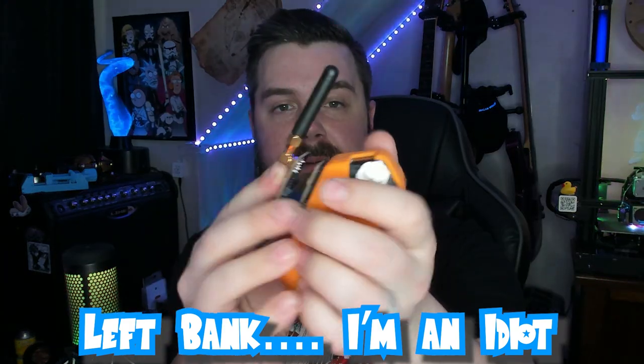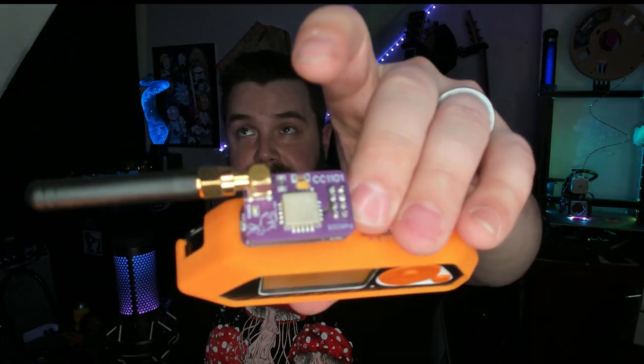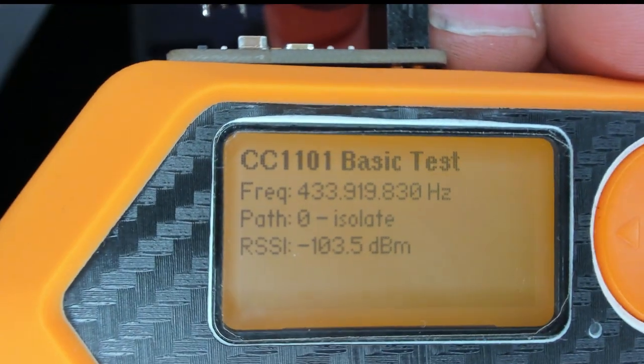The next one we're going to look at is the CC 1101 left-handed GPIO board. This plugs right into the top — it plugs into the right bank and goes right over here. That's how it works. We're going to run a benchmark to see how well this thing works without the antenna. I'll open up the sub gigahertz program and if you scroll all the way down to the bottom, you'll notice it says 'test.' You can test the carrier. Right now this is not using the external antenna. Our baseline is right around negative 100 to negative 103, and it bounces around a little bit. That's the internal CC 1101.